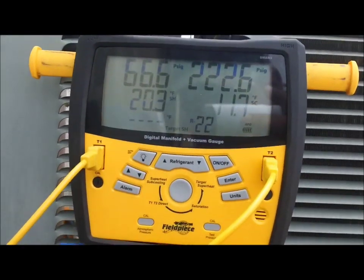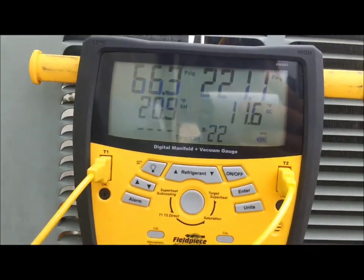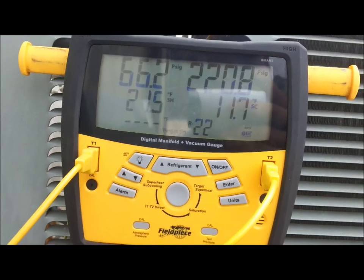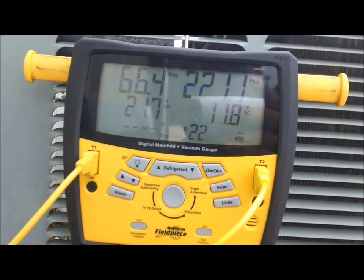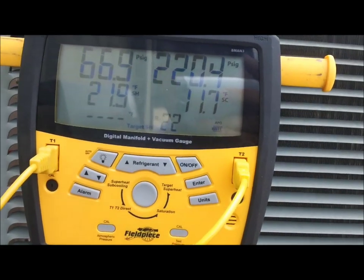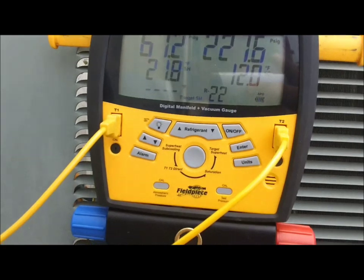All this was, was another company coming out here and throwing their gauges on it. Like I've told Zach and Fritz on the phone, they don't know what superheat and subcooling is. They just throw their gauges on here, stick their hand on the suction line, saw a low suction due to the dirty evaporator, the line wasn't cold, so they just loaded them up with refrigerant till the line got cold and hauled ass. They still didn't do the customer any good. My dad had done some plumbing work over here and we ended up picking up the air conditioning too. I come over here, find a dirty evaporator, and now you can see the difference from earlier. So it just goes to show guys — take your time, don't come to a conclusion. The gas-and-go days are over. Beer-can cold doesn't work.